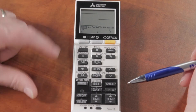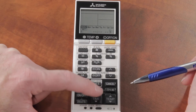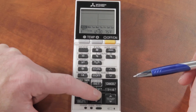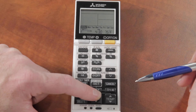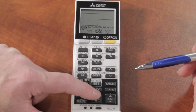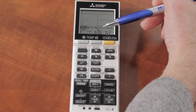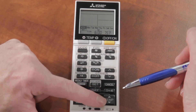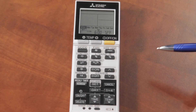The first thing to set is a time. I'm in program number one and I want to set the time for when I wake up in the morning — a little before I get up, say six o'clock. The time adjusts in ten-minute increments while you hold the button. At six a.m. I'll set the temperature to 72 degrees — use the temperature button in this section, not the buttons up top, as this is how you program it.